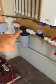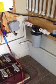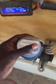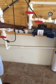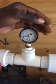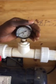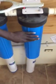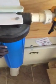The untreated water comes in from the roof right there and continues to the first filter. This is called the trash filter — it has the biggest holes in the filter just to take out any big particles in the water. Here's a counter so we can see how much water has come into the system. You have to know that so you know when it's time to replace the parts. Here's the pump, and here we have a meter to measure the pressure of the water. The second filter is 50 microns — there's the replacement they have ready to go when it's needed.